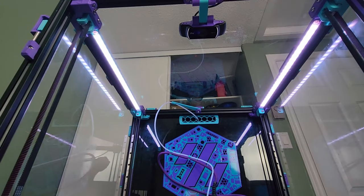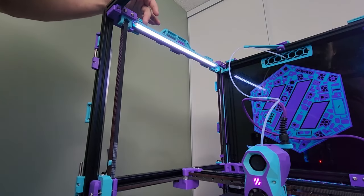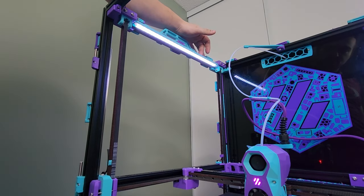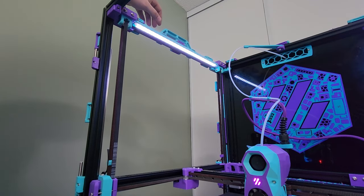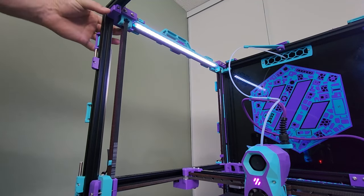At the top center opposite the PTFE support arm there's also a Logitech C920X. I highly recommend adding a webcam to your Voron — just not this one. Logitech cameras are expensive with cheap internals and don't play nice with Crowsnest or Klipper. There are also two Disco on a Stick XXL RGB strips mounted in carriers with diffusers at the top left and top right, with all cabling routed through corner cable covers that fit behind the Z-idlers.